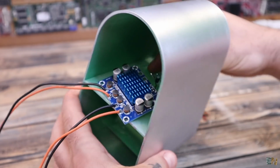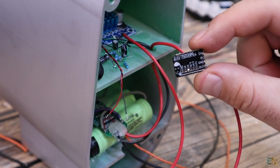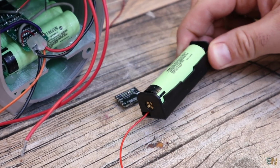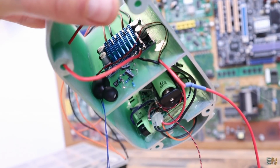But the circuit had a problem and I had to remove the buck converter. Why? Well, because it was creating too much noise and the sound quality was awful, so I had to place a separated battery just for the earbuds. Please check the final schematic with all the connections below in the description.